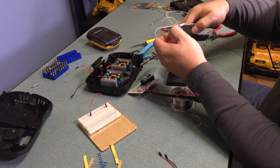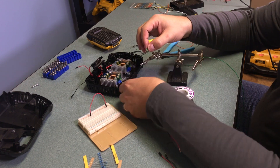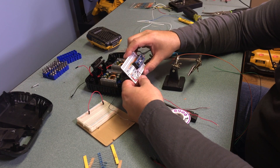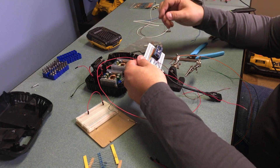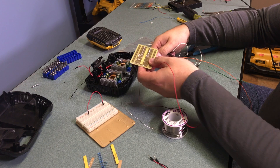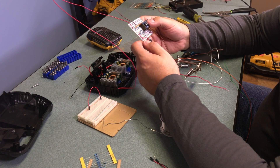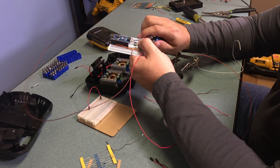I also need to take that voltage divider output and connect it to pin A0 on the Arduino — I could use any analog pin, but I chose A0. With that soldered in, I add 5-volt power to the Arduino and tie the Arduino ground pin to the battery ground. This is necessary for the voltage divider to work as an analog input. I also connect the 5-volt rail to the proto board rails to power all the 5-volt components.